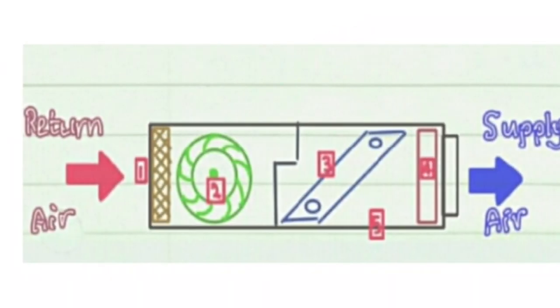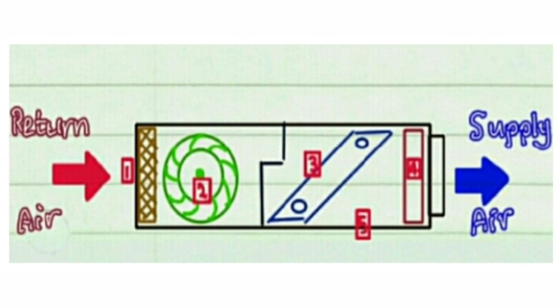Due to their simplicity and flexibility, fan coil units can be more economical to install than duct 100% fresh air systems, VAV, or central heating systems with air handling units or chilled beams. Various unit configurations are available, including horizontal, ceiling mounted, or vertical, floor mounted. Noise output from FCUs, like any other form of air conditioner, is principally due to the design of the unit and the building materials around it. Some offer noise levels as low as NR25 or NC25.